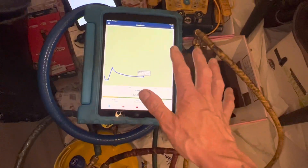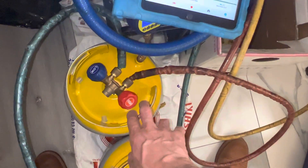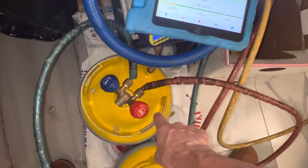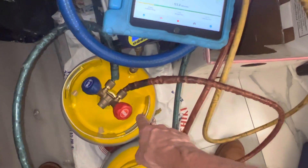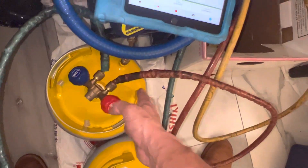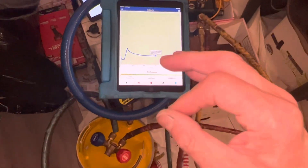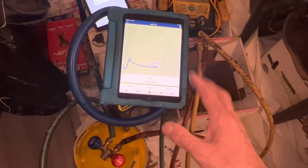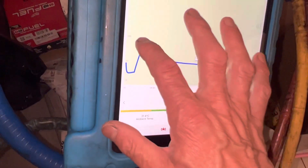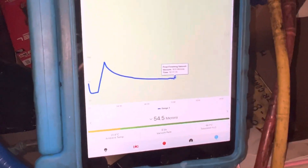I have to stress this: these are ideal conditions. There are no rubber hoses here. This is not a car or an HVAC split system that has been used — there's never been any refrigerant or oil in here. It was on a vacuum pump all overnight and brought down clean to 26 microns. So this is the most ideal laboratory condition that you will not have out in the field. Let's come back after a little while and see where that is — having some screen problems, but we'll be back.